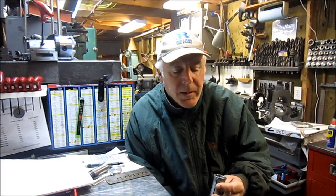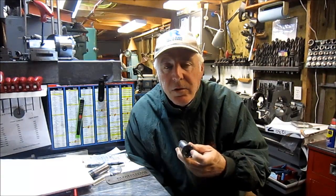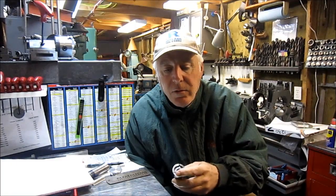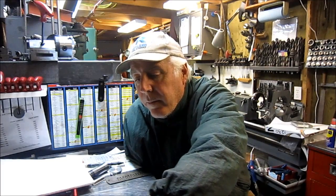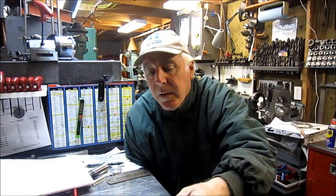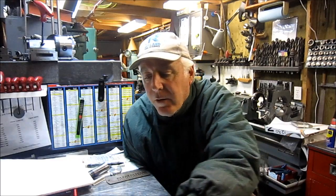The other interesting part about this video is using a machinable collet, sometimes called emergency collets, to make a washer out of a copper washer, making a very small part out of it, and mounting it in the machinable collet. So I think you might enjoy that.